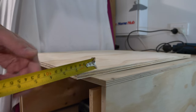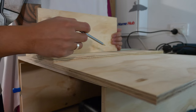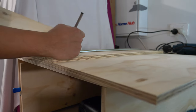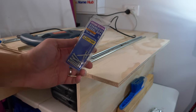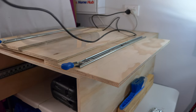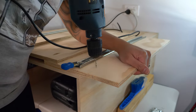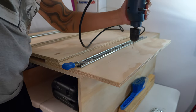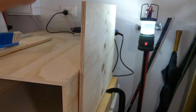I've just done dots there. Now I'm just doing the measurement and drawing a line so that I know where I'm going to be screwing it in. I'm going to pre-drill some holes so that I can put in these stainless steel screws. This hole will go through to the other side. Just clamping this together so that I can drill on top here.